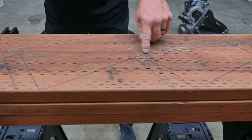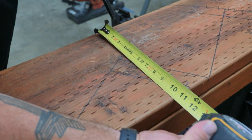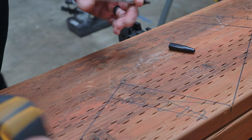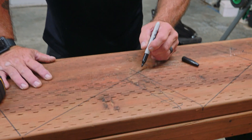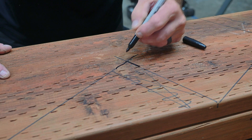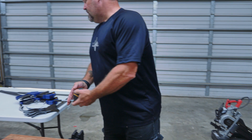The one thing I'm going to tell you right now: don't overcut this piece right here. To code, you've got to have five inches between the innermost cut and the end of your board. Right here I've got five and an eighth, but if you take a jigsaw or skill saw and you overcut this line — I see it done all the time — don't do it. You just ruined your board. It could fail code. You just spent all this money and time cutting out these stair jacks, so always use a jigsaw to finish this cut. Don't cut past this point — that's a no-no.